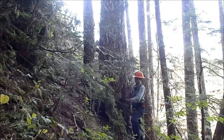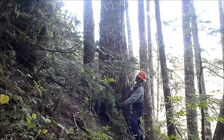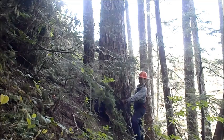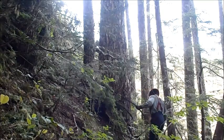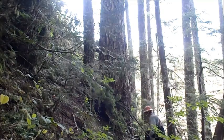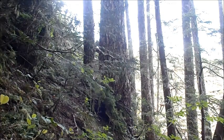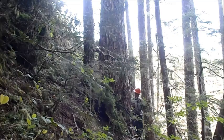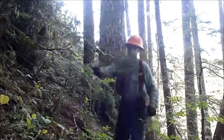If it flies up the tree, the yarder has more leverage on it — way better chance of pulling it over. Down low on the nice fir like this on the bottom side, it's not going anywhere. That's how you hang your strap, now for the block.